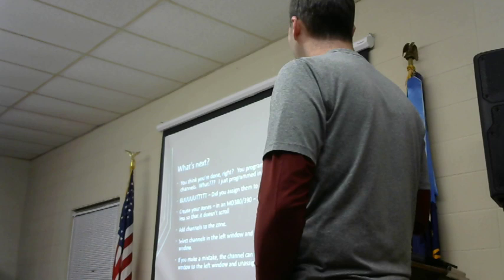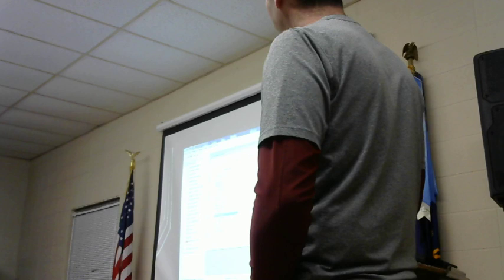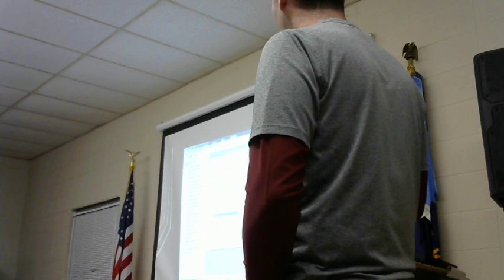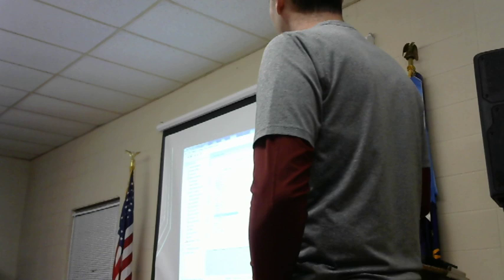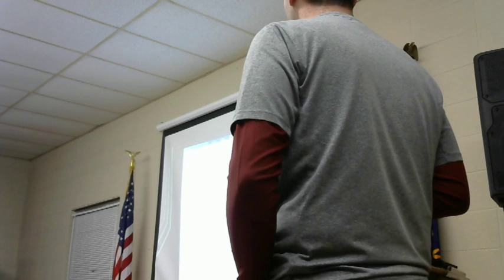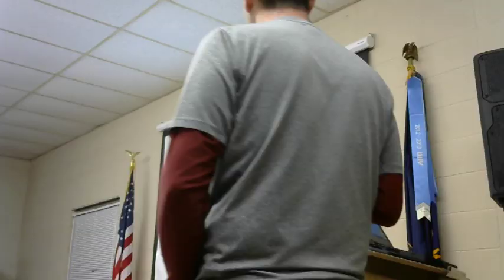So you can see here, this is the tree on the side. We've gone through making a scan list, setting up your channels down here. Now you have your zones. It's real simple. This is all your available channels, and you're going to add them to your zone over here. Just highlight it, select the add button, and it shows up over here. The one bad thing about using the TYT or the AnyTone software is once you do this, it's in that order. You can't change it, so you have to delete it and redo it. But if you use Contact Manager, you don't have to do that. We'll talk about Contact Manager in a minute. It's a really neat piece of software.